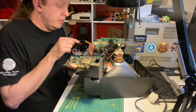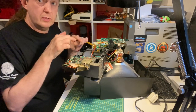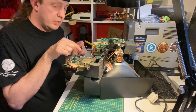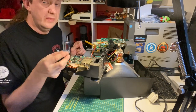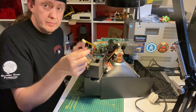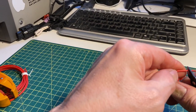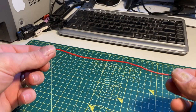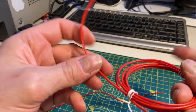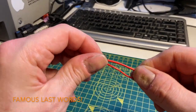The first thing we need to do is solder our new wire onto two points of the potentiometer, which is the on/off and volume control. We'll solder straight to that rather than the points that were on the board before. We're also going to take a point on the motherboard that has five volts running to it to power the amp. Those are the three main connections going to the amp, and the amp's output will go to the speaker cable. We need about six inches of wire. There's a thin red wire for the five-volt supply, and I'm going to use thicker insulated wire for the signal rather than shielded cable, which works fine for me.